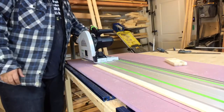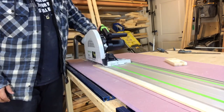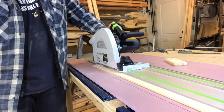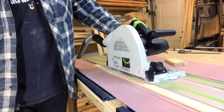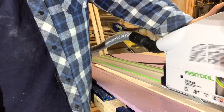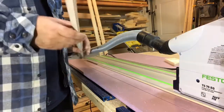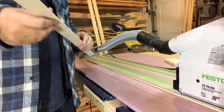Here I am about to do a test piece of quarter inch plywood. You'll notice that underneath the plywood I have put a half inch insulation foam so that I don't cut my table — I got that tip from Rob at Stone City Woodworks. Look how nice it cut it — nice and splinter free.